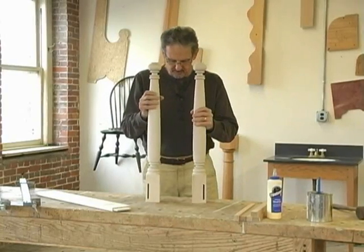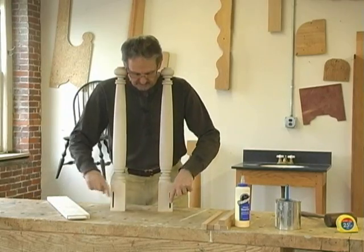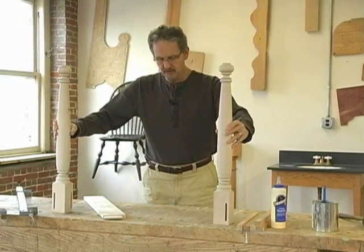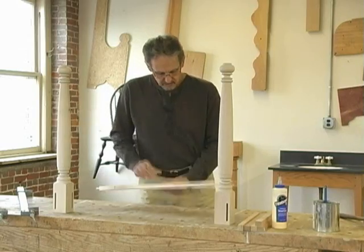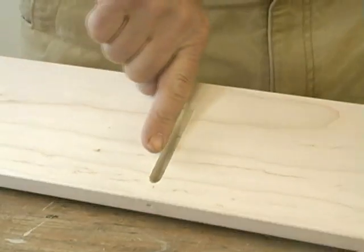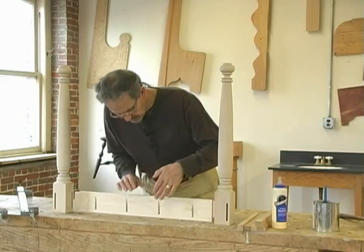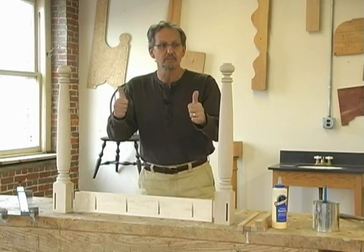The way these mortises line up, I now have 2 mortises here, which is where an apron can go, and it leaves 2 mortises here. So you've got to get your legs in the right orientation. If I know that I want to put an apron in there, your apron goes on so that if your legs are up in the air and you put this up, these holes are here. So the finished part of your apron is on this outside part here, and these holes go down so that when I turn this up, those holes that are going down would go up into the top.